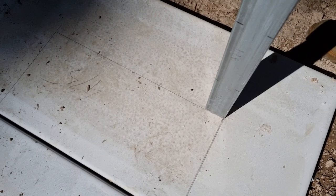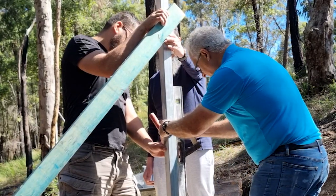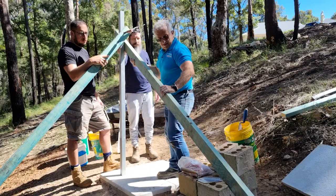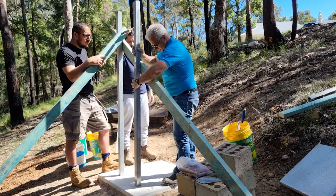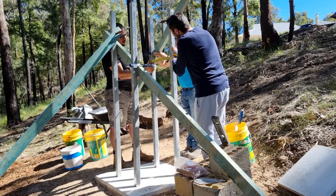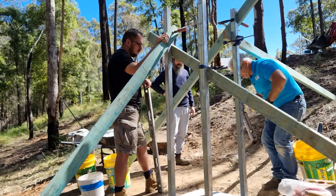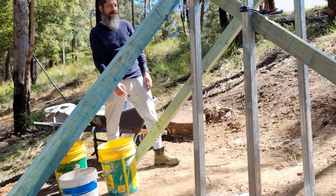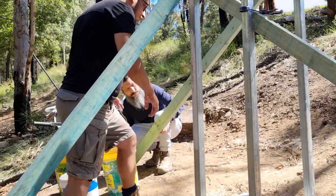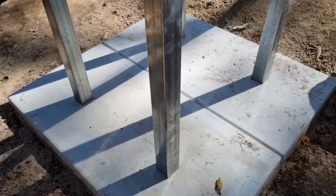So now you just put a piece of timber here, ram it in the ground so it doesn't move. In this case I'm going to use an F clamp and a quick grip. I'm leveling the post — we've got the profile going this way, and now we're going to go the opposite direction. It took a bit of work, but the profiles are all in, they're all on the mark, and it's looking really good. Now we'll make the mix of cement and we'll start bricklaying.